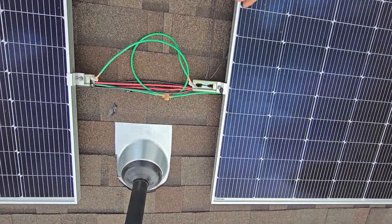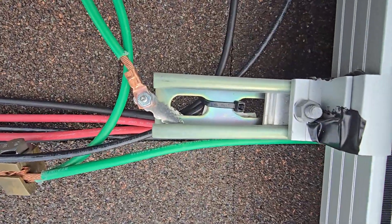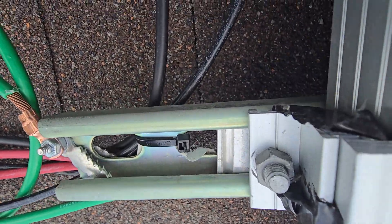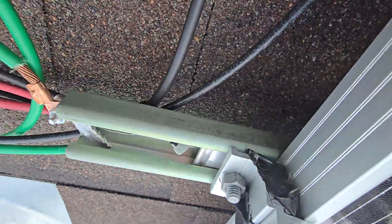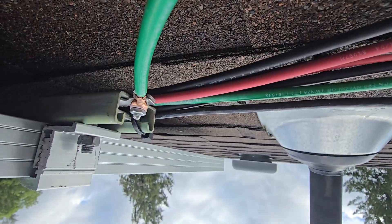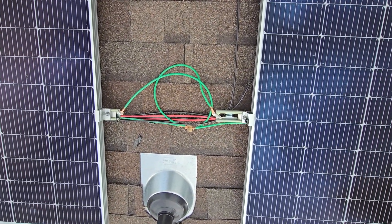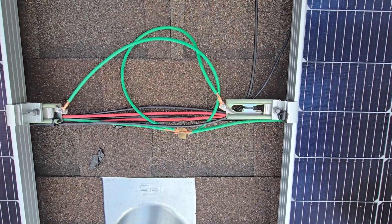And those are Casey clips — they are phone man's clips for grounding out phone cables. Basically, there's little jagged edges on both sides of that thing, and then two screws that clamp it down. One clamps down the jaws, and the other one clamps the wire on to it. You could probably stop any phone guy along the road and say, hey, you got any Casey clips? And they'd probably give them to you.